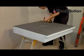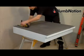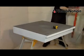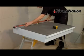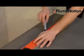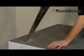If the area where the wet zone is being fitted is smaller than 1850mm in length, you will need to cut the shower tray extension piece down to fit the size of the area. When cutting the extension piece down in size, please make sure you cut the end with no lip, as there is a 10mm pre-formed fall to take the water towards the shower waste. Simply mark the product as shown and cut with a handsaw.